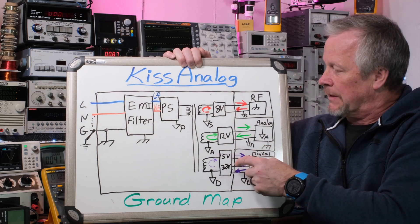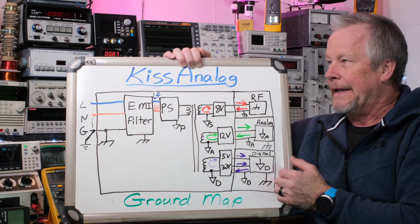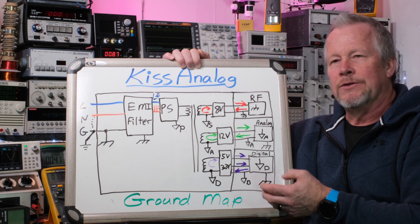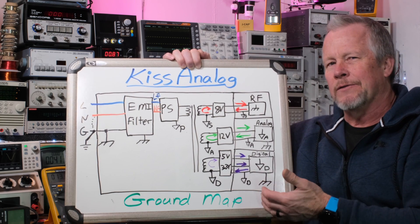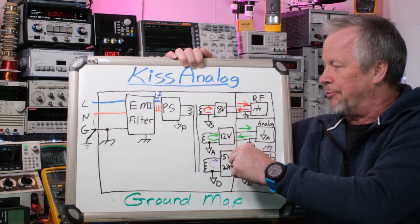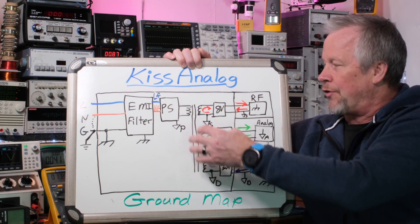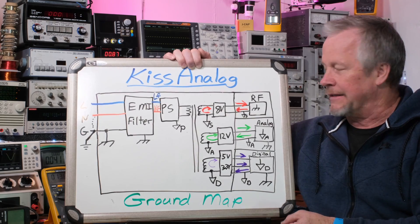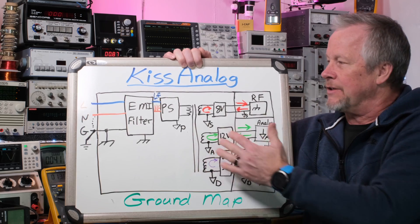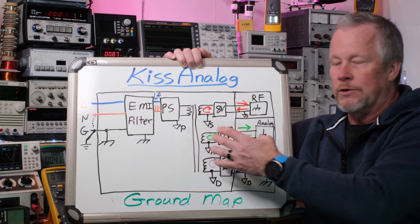Then we check to make sure each output is isolated from the other. In that case, we don't necessarily use 1,000V plus two times — there are different levels. You might do 100, 500, or 1,000 volts. You check the isolation to make sure there's no breakdown between windings, verifying the transformer is wound correctly with proper insulation. That way there's no shorting from the primary to the secondary side causing a high-voltage hazard.